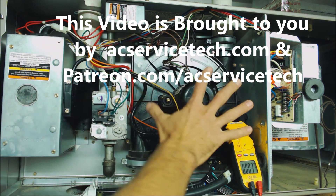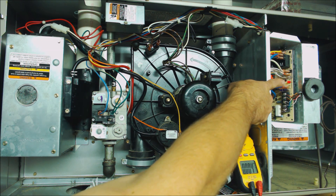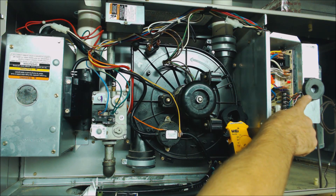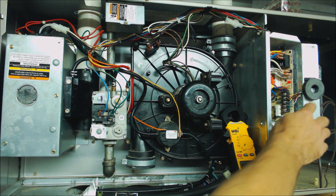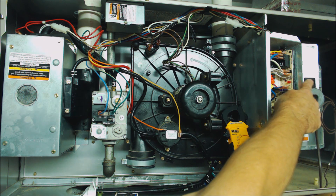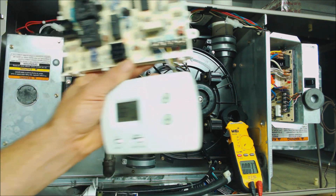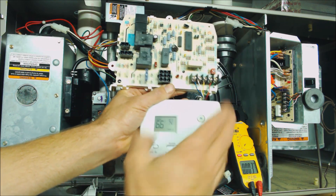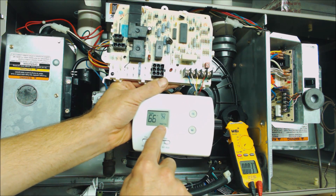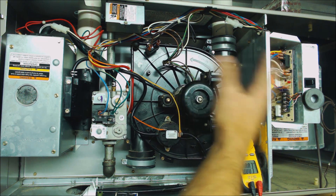In this case we have a gas furnace and a control board. You see that the status code — that red little light right there — it's not flashing. We have the door switch shut with a magnet right now, so you can see that turns the power off, but when we close this door switch we then have power at the control board. If you want to see if your thermostat is actually working properly, we need to take our readings at the control board of the furnace.